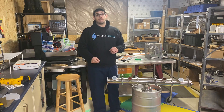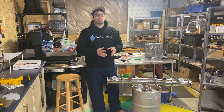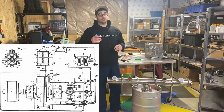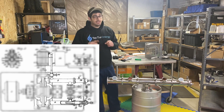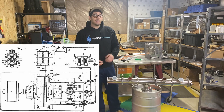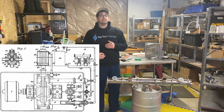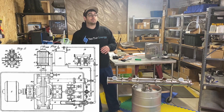In normal gas turbines you shove in much more air than the stoichiometric combustion mixture requires, because you need that extra air for cooling to prevent component overheating. What Tesla designed in GB 186083 was a way to cool the combustion chamber using steam at 100 degrees Celsius instead. Even at 100°C, the steam easily cools a glowing-hot combustion chamber, dumping that heat into the steam. And steam is excellent at storing energy for utilization through expansion and heating.